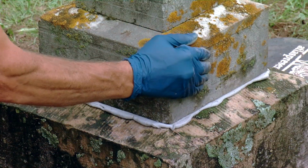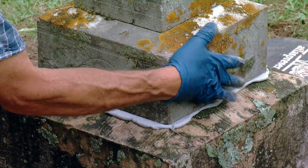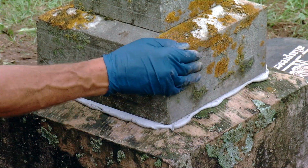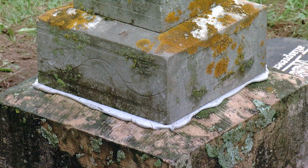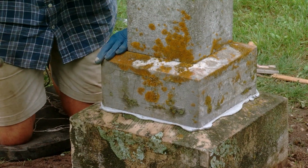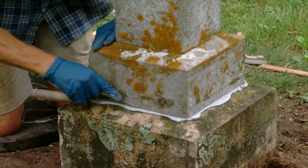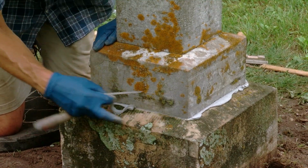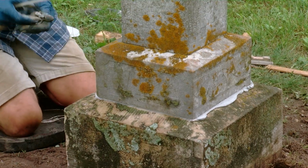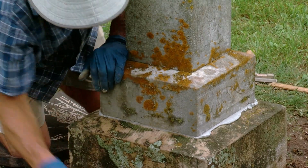Okay. Now, by eye, it's hard to see because of the squeeze out, but the last step will be trimming it now, and then we could still fine tune it. Just looking for a trowel. This is called a tuck pointer, a 3/8 inch tuck pointer. This is one of the most important tools for doing a lot of work, especially mortar work, which we'll do with stones that have keyways in them, or in other types of repairs.